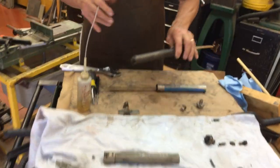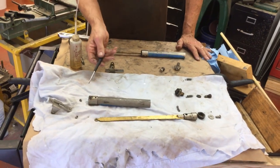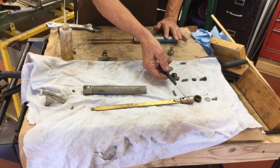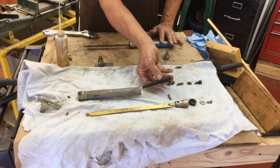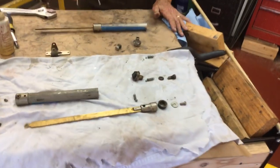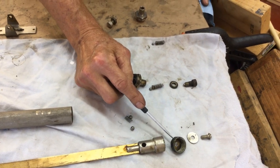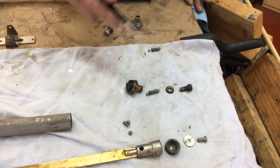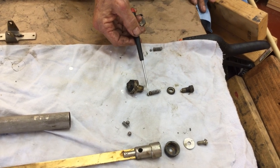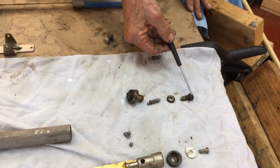Let me discuss this — I'm going to remove this one. This is what the SIG pot looks like taken apart. This is the bracket. You have two screws. We have the tube that it goes into, and this goes in this way. The screwdriver is because this is the top and this is the bottom. Here's the big mistake everybody makes: this spring and those two ball bearings fit in that hole, which holds the leather gasket, the washer, and the screw. This goes to the bottom. This goes in first, then the ball bearing, then the two springs and the brass piece — I'll discuss that later — the retaining ring, and then this screw goes into the bottom.